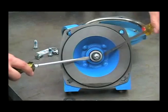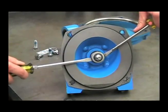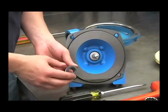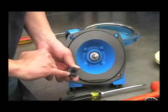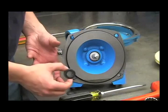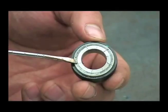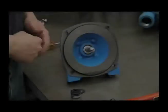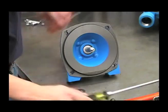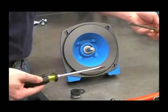Take your two screwdrivers and pry out the mechanical seal. Examine this for any wear, any surface damage from an abrasive substance, and also if the seal is melted or cracked from being run dry. Here's an example of a seal that had been run dry. It is possible to remove the seat by prying it out with two screwdrivers, but this will most likely damage the seal and you'd want to replace it.